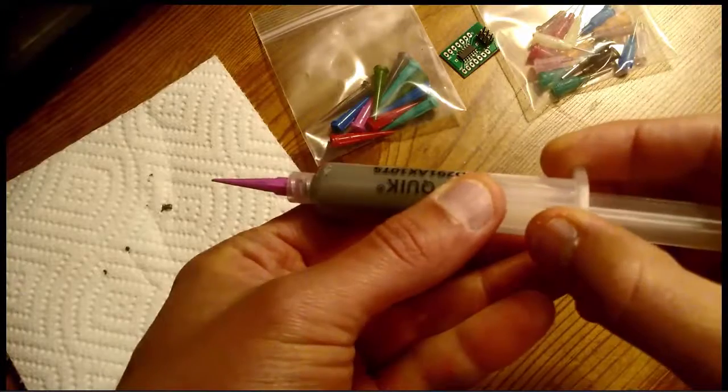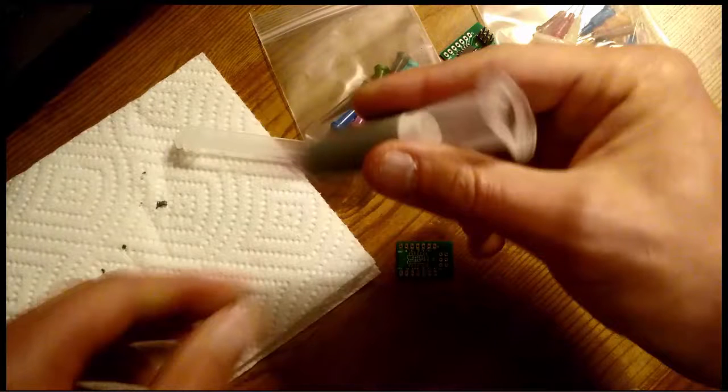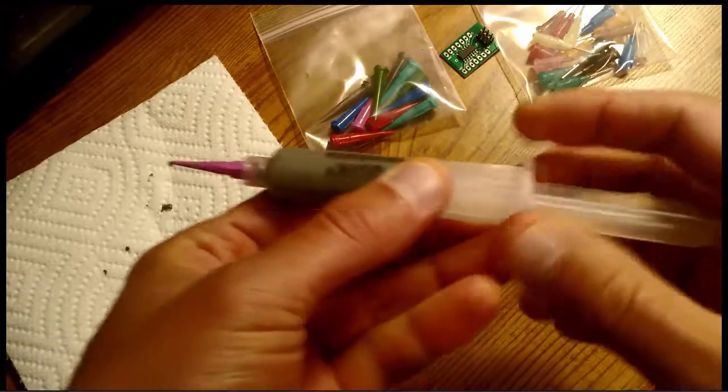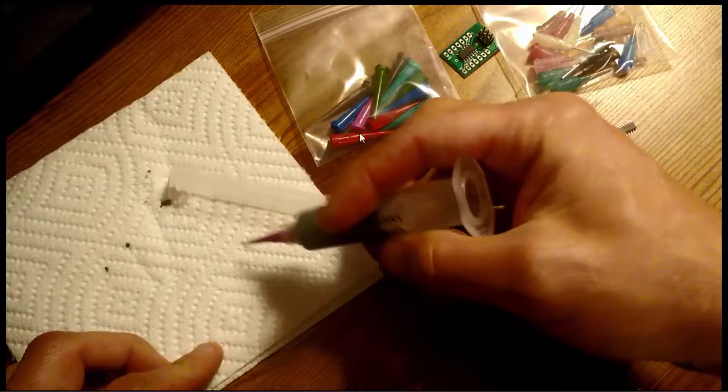I'm going to recommend a thermocouple temperature sensor. A thermocouple basically uses two dissimilar metals put together — when you do that, a voltage or current will flow, and based on the temperature, that current will vary. That's how a thermocouple works. You can buy thermocouple boards, and I'm going to have a thermocouple measurement instrument in my example. The reason we're using a thermocouple is because it's very tolerant to high heat, so you have the probe going into the toaster oven.